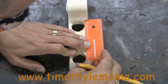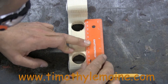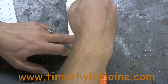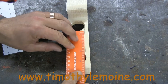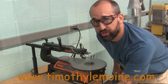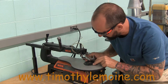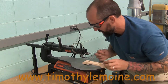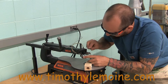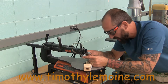Feeling for the edges — and scribe in a line. Step four is to head over to the scroll saw. For this you may not know, but a scroll saw blade can come out and you can connect it and get it inside of a slot. If you don't know how to do that, you can check out my video linked at the end of this — it's called 'Making Internal Cuts.' It will teach you the process for doing this.